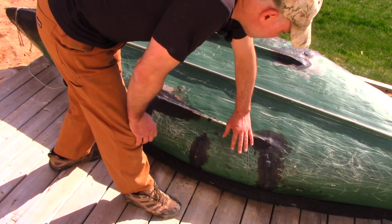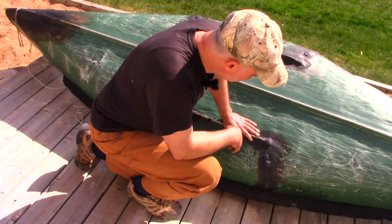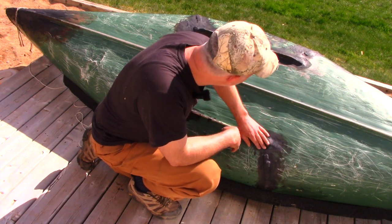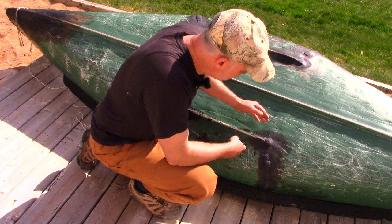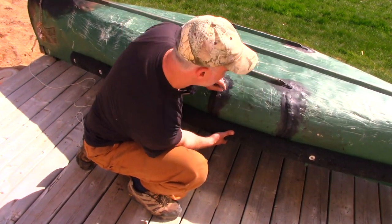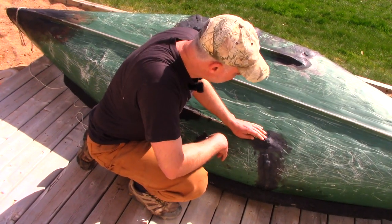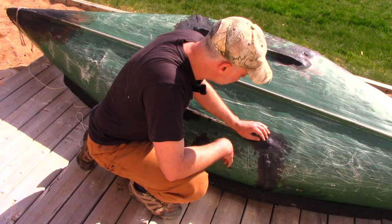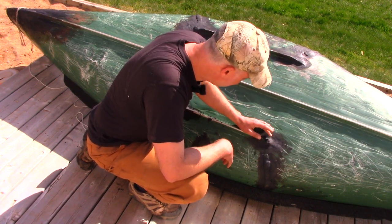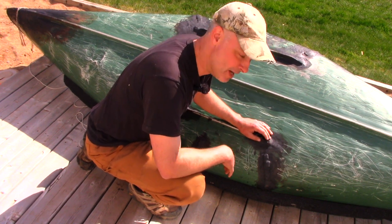Right, you put the roofing tar on, then you let it bake in the sun so it gets really good and hard. If it's not smooth and you're laying it on, you just rub a little bit of turpentine on it, believe it or not. But that's, for me, analogous, again, to go back, look at the way these seams look. Very much like a birch bark canoe, right? Analogous to a birch bark canoe, instead of using spruce pitch, I suppose, to mend seams and stuff like that. I thought, well, roofing tar is just sort of like a lazy man's version of that, right?